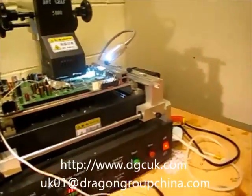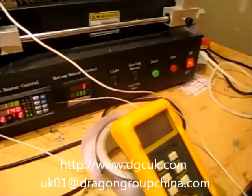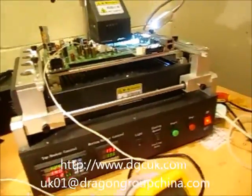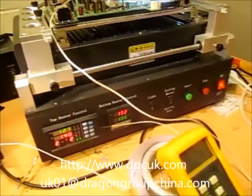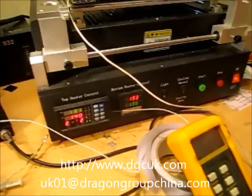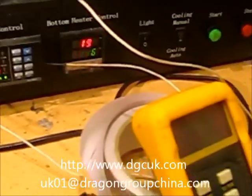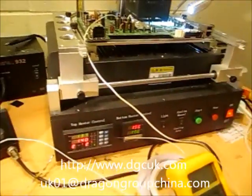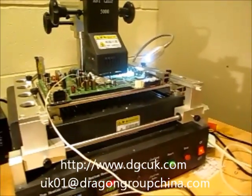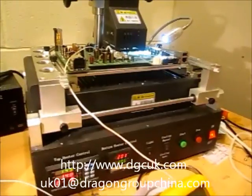You can see now the readings are quite different — here it's 200, that one is still 100. So this is the rear temperature on the chip. It's probably where a lot of people have a problem — calibrating the top heater and the thermocouples to get the right profile. But once you've got your profile sorted out correctly, then every one that you do is almost the same and you shouldn't have a problem.